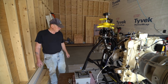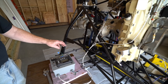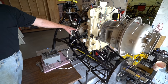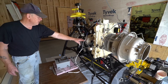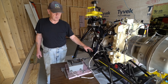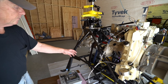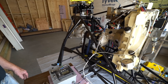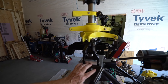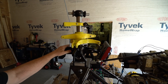The airframe was pretty much a stock airframe — we just added a base to it so it can roll around on wheels. The engine installation is quite similar to the way the manufacturer of the kit intended. The drive to the tail rotor I redesigned and changed because of what we had here as a demonstrator, and I wasn't going to connect up an alternator and other things normally connected on the helicopter. All this bracketry down here was custom made. The rotor head is pretty much stock, though I modified the bracket from its original intention and tightened things up so we don't get much movement in the swashplate.